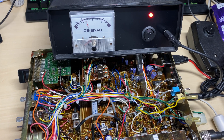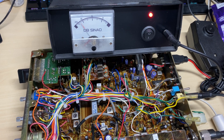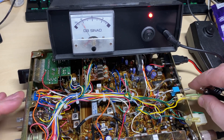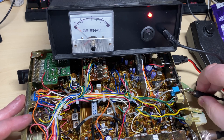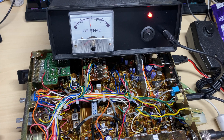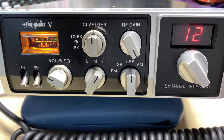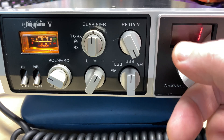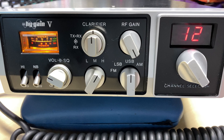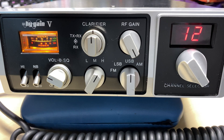And of course for all the SINAD fanboys, let's have a look at that. We're on minus 110 to 115 dB - absolutely fine. In the real world that'll be minus 70 dB up to minus 100 dB. The meter's back in and we're up to about minus 115 dB, so it's fine. The receiver is working quite nicely. And there we have another High Gain 5 that lives to see another day - not bad condition, shame about the paint worn off the front, but you know, wear and tear. If you like this video don't forget to like, share, subscribe, comment, join the Facebook group, buy me a coffee, join Patreon, have a look at my website.